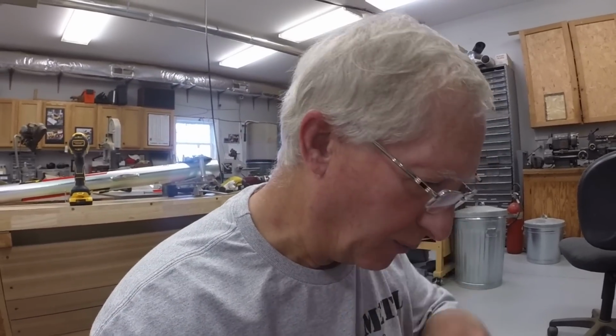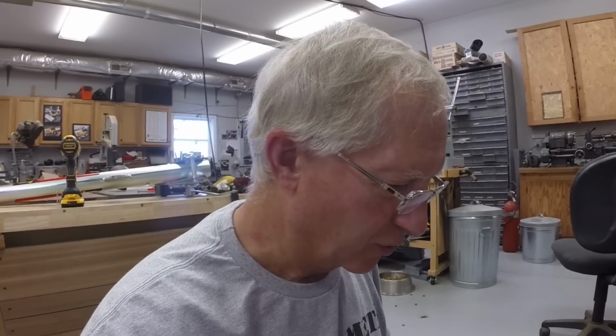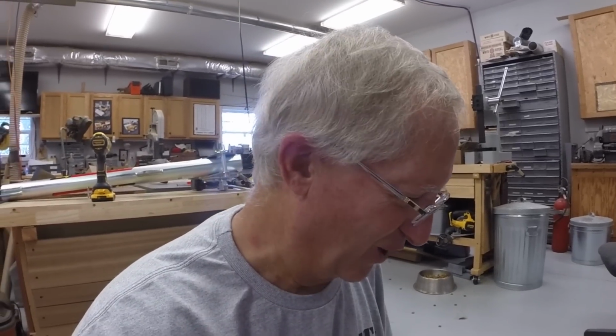Anyway, I finished up the holes with my corded Hitachi 1/2-inch drill. It wasn't a hammer drill, but it worked okay. I actually broke the carbide tip on one of the 5/8 inch drill bits. I had a second one, so I put that in there and finished off the holes. So I cut the expander sleeves to the appropriate length for each hole. And so next thing I'm going to do is go ahead and set the anchors in the holes, and then we'll set the base plate on it and see how this goes.